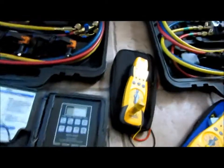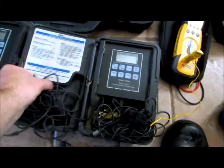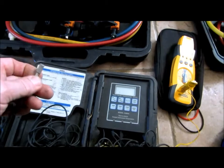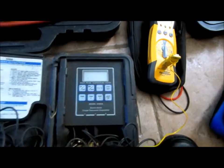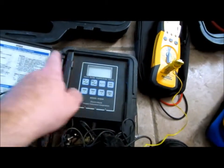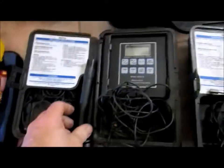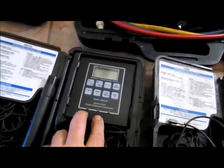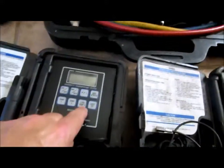I've got a couple of Cooper meters here — I've used these for years. What I like about them is you can hook two probes up. Back when I used my analog gauges, I'd just clamp this on the suction and liquid line, and by pushing one or two you get the temperature reading with the differential. This other Cooper has two sensing ports — temperature one, temperature two — and also does wet bulb, dry bulb, and relative humidity on the number three setting.